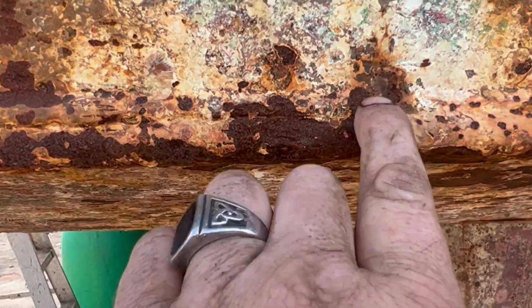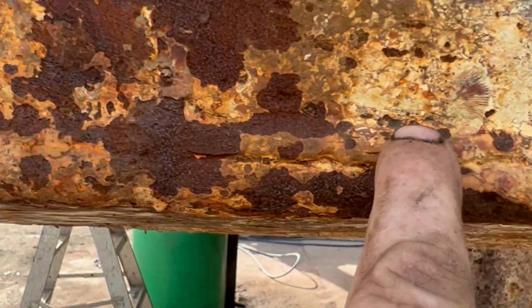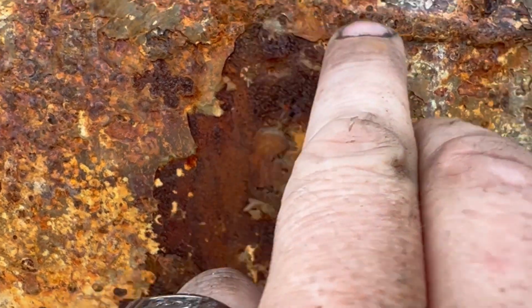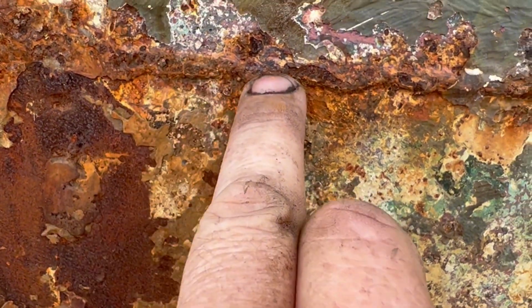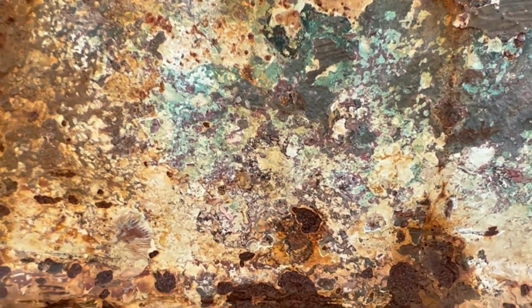There it goes down there. There's the holes there. There's the camera. There's the holes there. You can see this is where they've welded on. But they never welded the inside, they've just welded the outside, and it's actually quite a bulbous weld. It actually hasn't penetrated very well. And there's very minimal penetration, so I'll probably grind all this out.